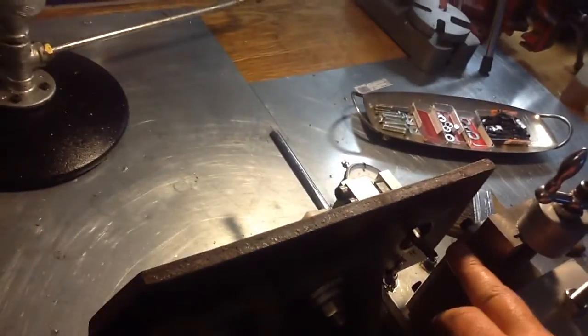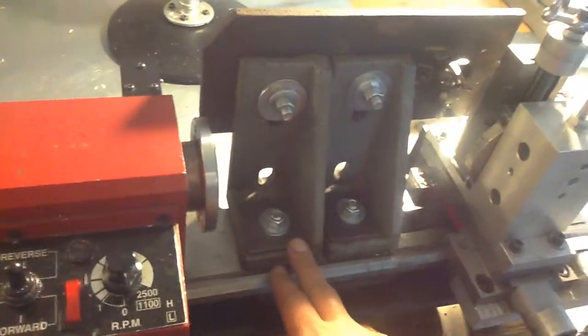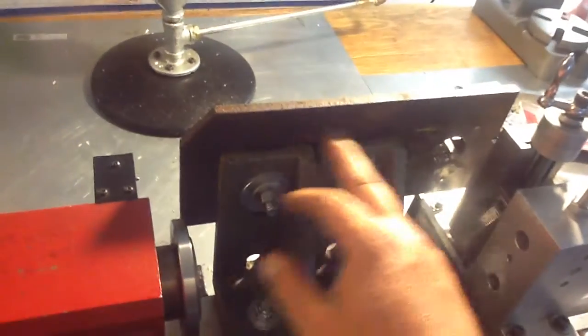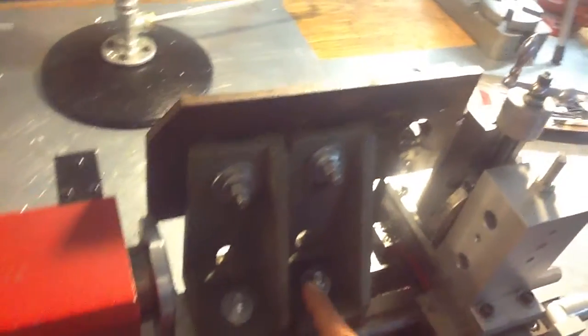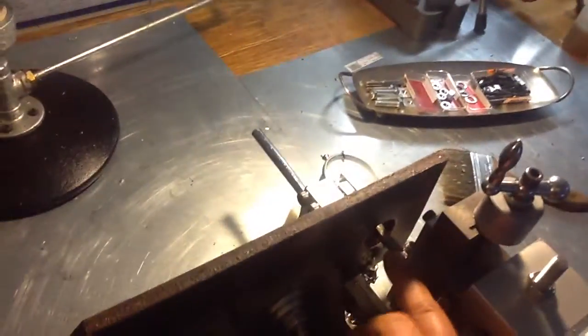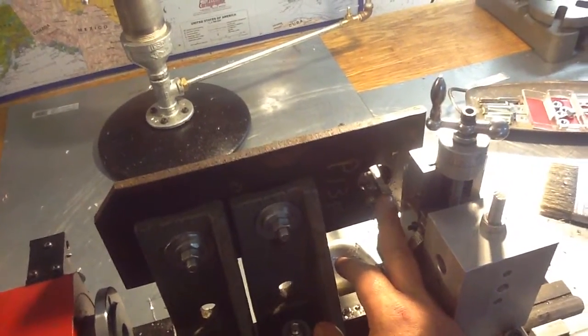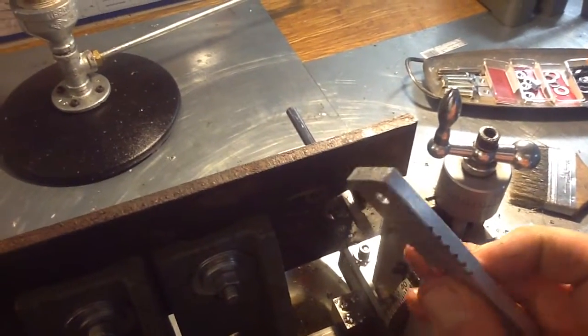So my shaping paradigm here is that I'm bolting the work onto here and the tool is stationary. I've got some junkyard treasures here — I think this is architectural steel, just some right angle blocks and a piece of bracketing. This is maybe $20 worth of steel from the junkyard. Got it firmly bolted onto the lathe, got the plate bolted over here and then the tool right there. Sorry about the lighting, but you can see the tool steel — just a standard lathe tool ground to the profile of this thing here. I've ground the tool to that profile and it's just connected with a block of aluminum bolted onto the plate. So the tool is stationary and the work is moving.